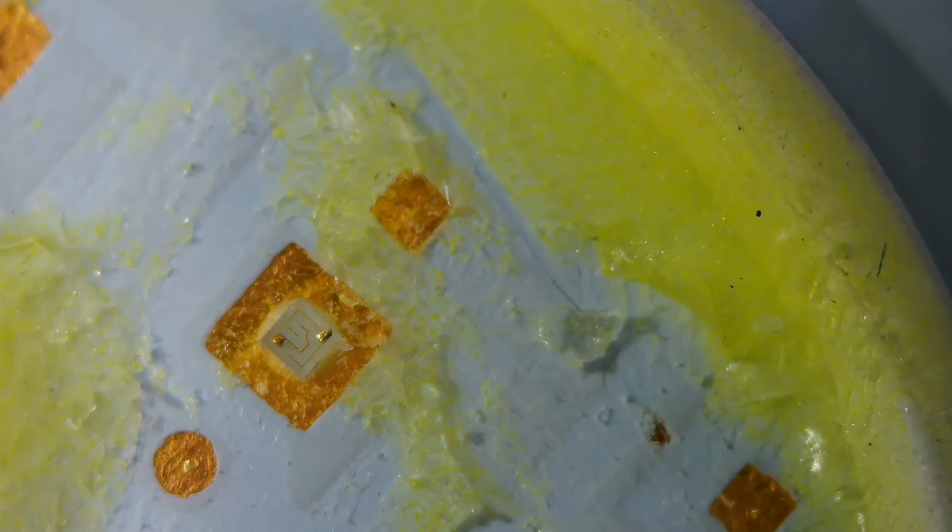Let me zoom in. Okay, there's an individual diode. There are white LEDs, but typically your white LED is a mixture of phosphor, that yellow stuff, sitting in front of a UV LED. So that's what these LEDs look like, chip on board. And these have a very wide, very broad dispersion, right? They're not focused in any way.